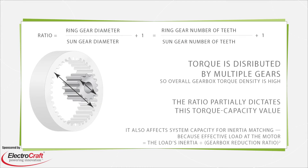Planetary gear assemblies handle load in a way that makes them especially suitable for applications with stringent stiffness requirements, dynamic loads or frequent stops and starts, the need for low inertia and high torque density, and a design objective of high efficiency. Most standard gearing transmits the axis's whole load through one gear mesh. In contrast, the gears in planetary gearboxes usually have at least three gear meshes in action.